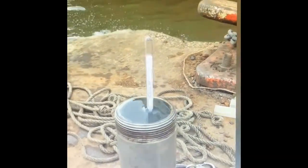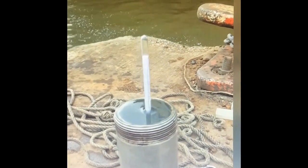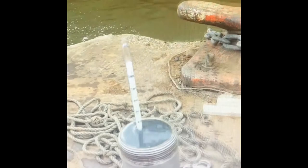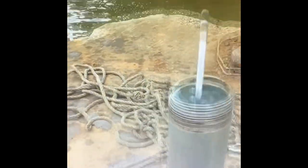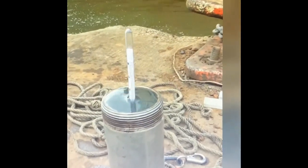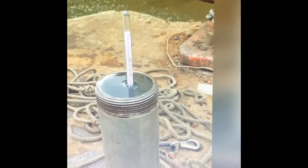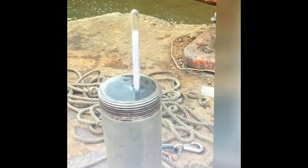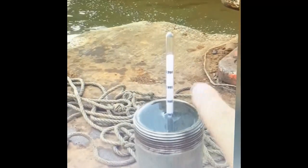The hydrometer settles after breaking the surface tension. The water is very clean — there is nothing in it — because it has been taken from the midship area of the ship, which is free of discharges. Take a clean sample, allow the hydrometer to settle, and you can also give the surface a little tap to break the surface tension. Once settled, note down the density reading.